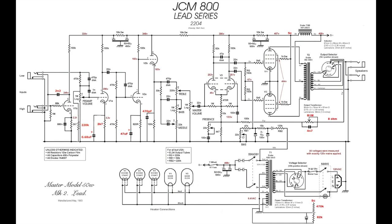It's about 65 volts at this point here. What we're doing is I've labeled this screen supply, and here's the screen supply node. SC for screen supply, which is used to feed the screens of the power tubes. You tap off that, and you create a 470K and an 82K voltage divider with about a 10 microfarad electro cap here, is what I normally use, which just helps to filter it and keep it nice and clean DC. So you've got a 65 volt DC reference here, and that becomes the center tap for the heaters.